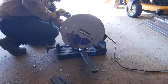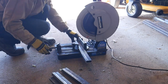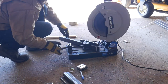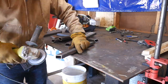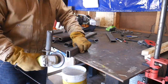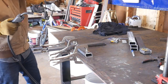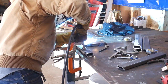Now we need a base, so I'm heading to the other garage where I have all my metalworking gear. I'm using this cold cut saw to chop the steel into more manageable chunks. I designed this in SketchUp to get all my measurements and angles correct, then made that into a piece of wood to check everything, and used that as a template. I prepped all the joints with a 60-grit flap disc to clean everything up for a nice clean weld, then slowly worked my way around checking for square, doing a couple of tacks all the way around.